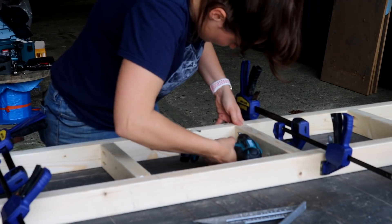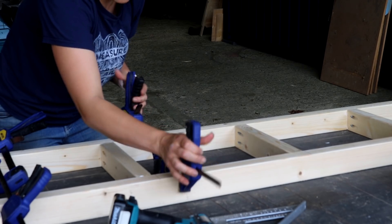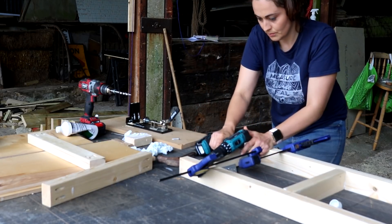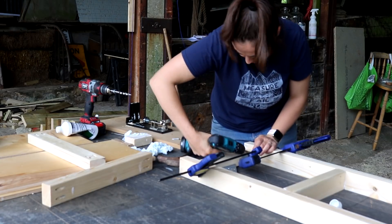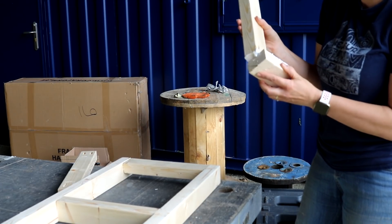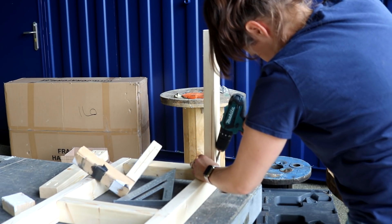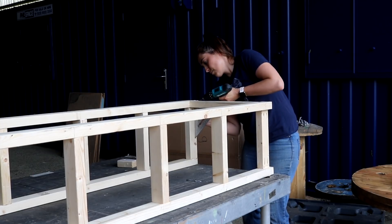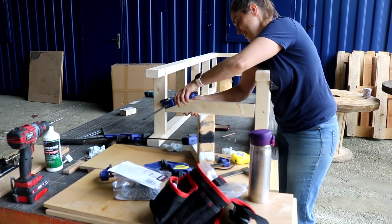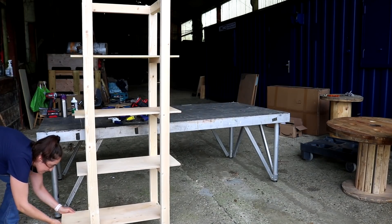I added two pocket hole screws per end. For the top piece, the widest part is facing down — it's kind of like a ladder design. Once that was done I unclamped it to get ready to screw the two sides together to the in-between support pieces. Instead of sash clamps I'm screwing the final two strips downwards while it's on its side. For the bottom shelf support I put that in the centre. Then for a quick visual I temporarily placed the shelves on top to get a feel, and I was happy.